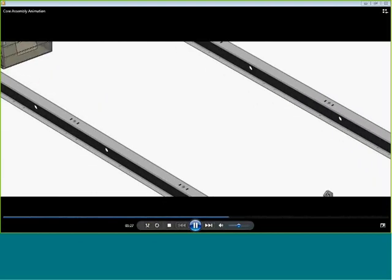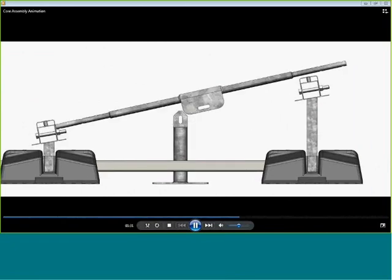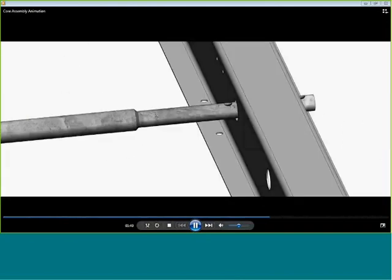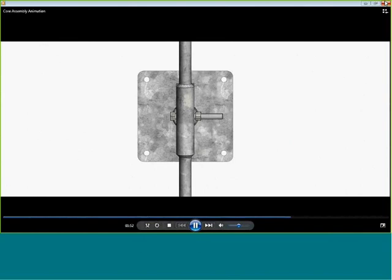For connected systems, there's a 2-inch diameter post, and that's fixed to the deck and can be flashed just like you would a pipe. The connector rod then slides into the pre-punched holes in the rail, and that's secured by 4 spring pins, 2 for each rail. And then the rod and the post are held together with that same half-inch hex bolt and nut, which was used for the rails and the links.